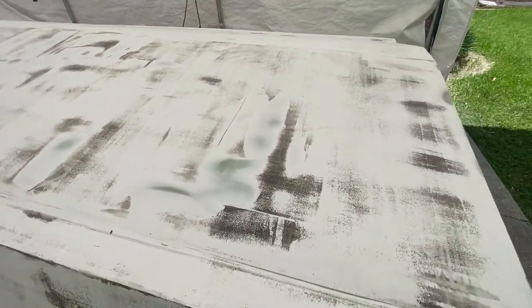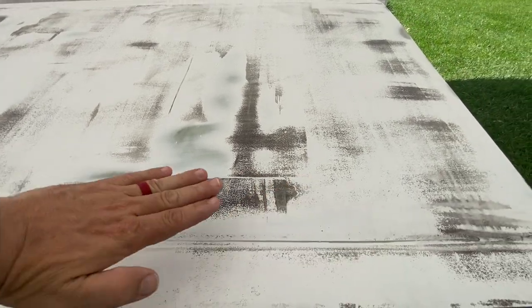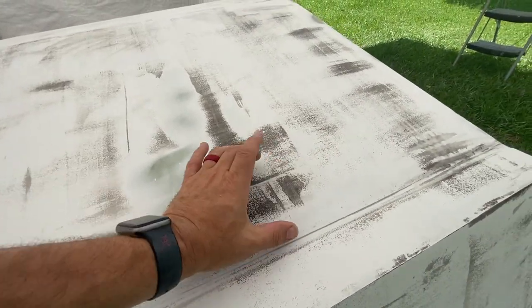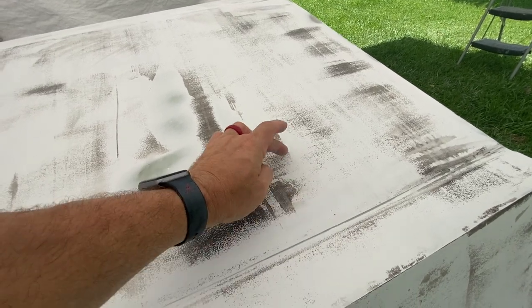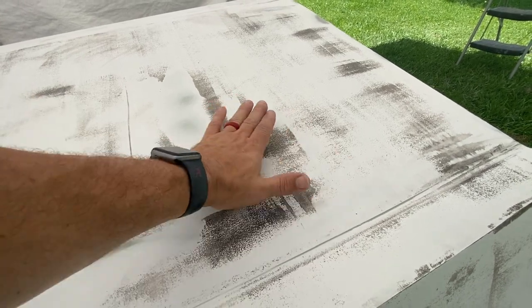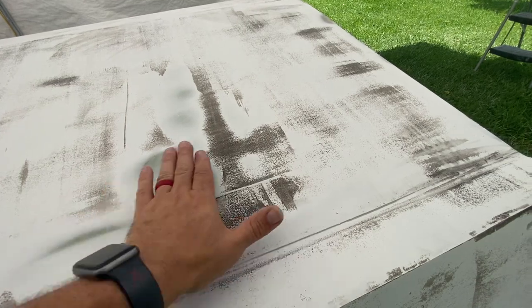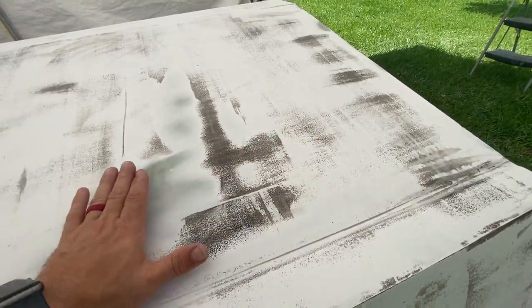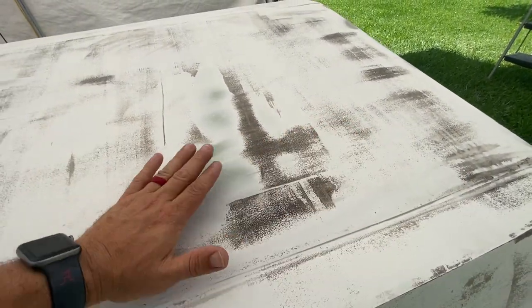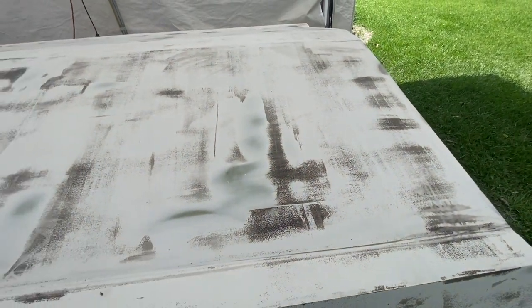I showed this also, I knew that this was an area where I could see it was rippled. But now the high points of this high build, like here, all of these white pieces are highs. They're not too high; they're actually flush and fair. So I'm hoping that when I pull this compound, there's enough of that to keep me flat.